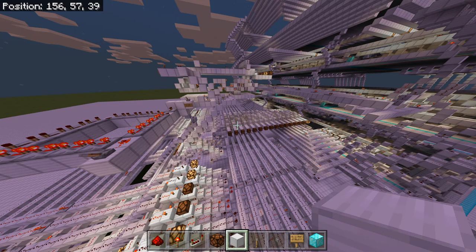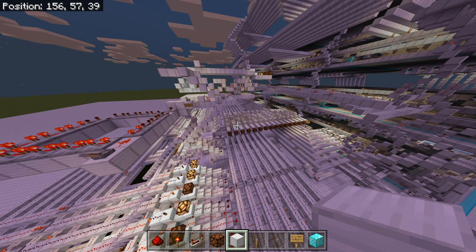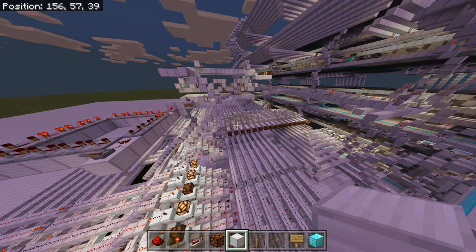Thanks for watching. This now seems to mostly be working. We have our opcode register, we have our clear signals linked up, we have the phase generation, and the clocks are linked up. So the last thing for tomorrow will be to essentially build the control path and link up the clock phase into those decoded signals as well. And then we'll be able to program the memory and attempt to run a program, which I've yet to write, but I'll figure it out.